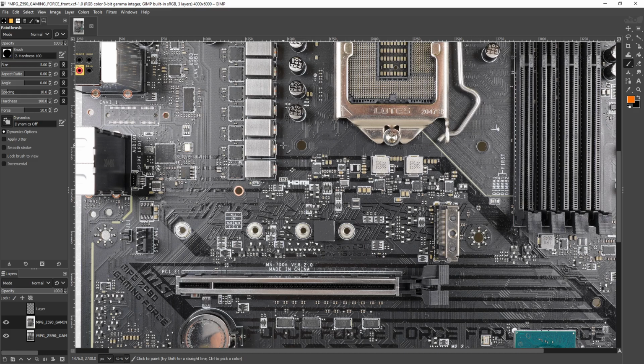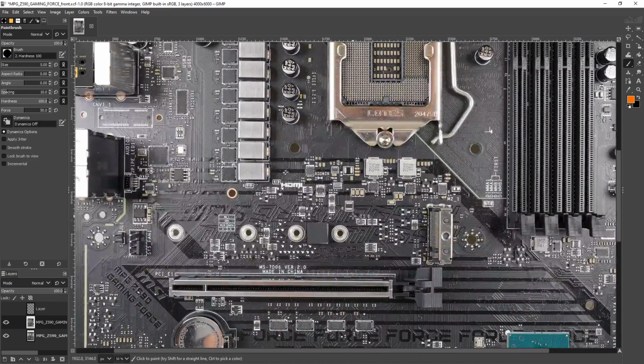But the problem I have with that is that 11th gen CPUs, because they have less L3 cache than their 10th gen counterparts, and they're also really expensive, aren't really good purchasing decisions. Not only did Intel reduce the L3 cache, they also made the memory controller have more latency. So first you reduce the cache, and then you slow down the memory controller. And it's like, oh man, literally going backwards.